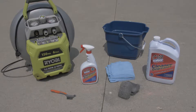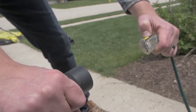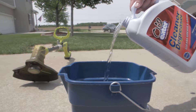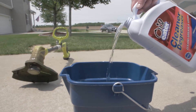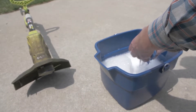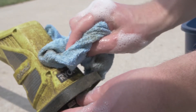Here's what to do. Take some precautions before you start and disconnect all power cords. Clean the nooks and crannies with compressed air. Fill the bucket with a 10 to 1 mixture of hot water and Oil Eater Cleaner Degreaser. Dip a rag in the solution and wring it out so it's just damp. Clean off the tool with the damp rag, avoiding power cables or motor casings.